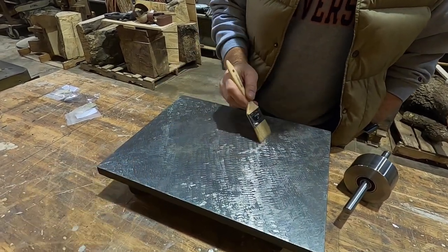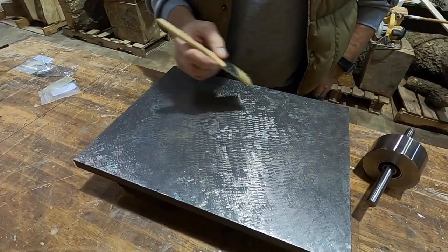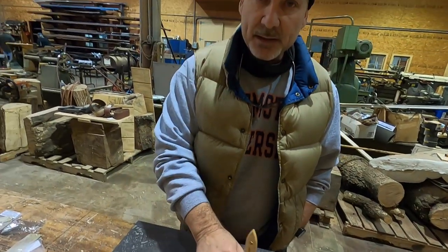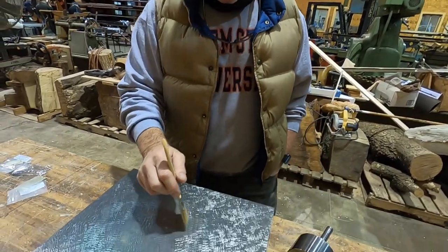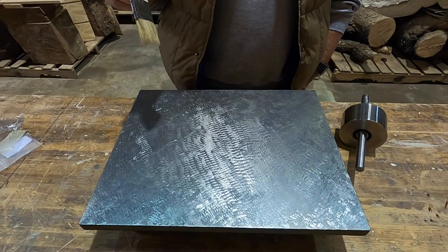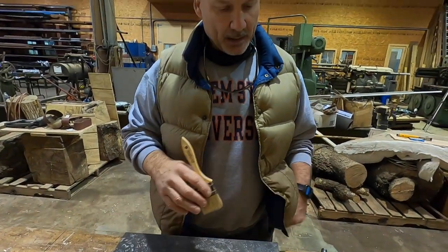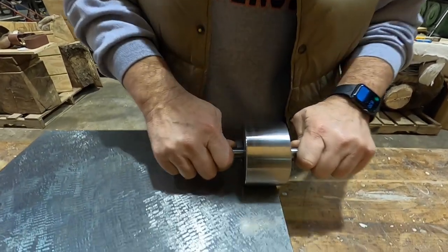To what you're doing and why you're doing this, what you're going to be using this for. And by the way, this is one of his cast iron surface plates that he just recently scraped in, and he's going to be using this as a lap. Yeah, so this plate is right around 50 pounds, which is a good size for a lap, good weight. I scraped it and mastered it to one of my A plates in my shop, which is a granite. And then we're going to spread this, which is actually about 40 micron diamond, evenly as best we can, and then we're going to use this roller and deeply embed it and basically create almost like a diamond sandpaper lap for resurfacing granite surface plates. Okay, and so that's the short story.